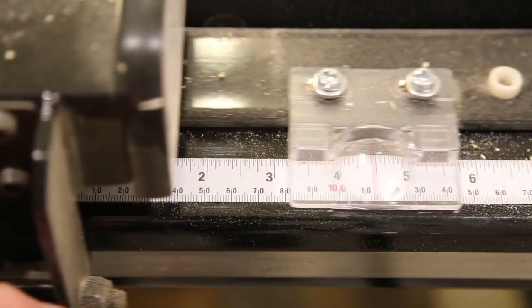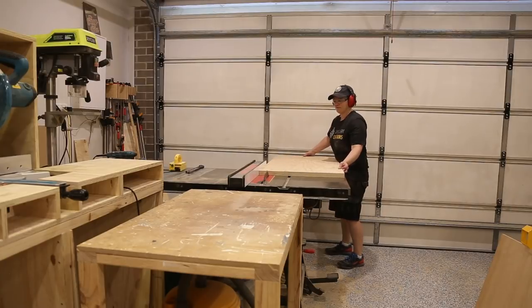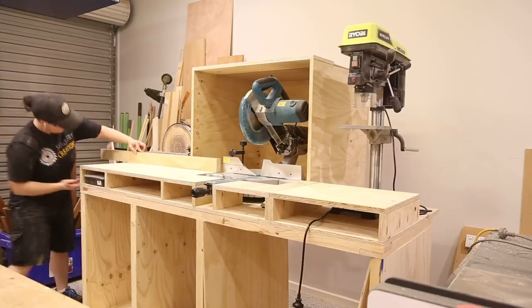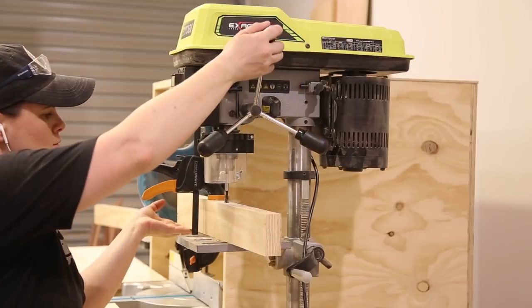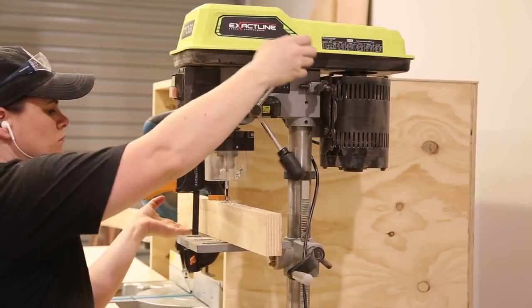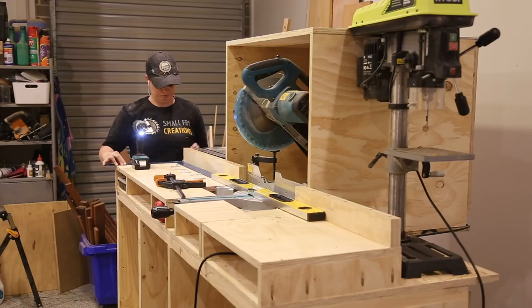The miter saw fence is made from 30mm plywood I had in the workshop — I cut 70mm wide strips. The fence sits just below the sander and will be substantial enough for the track and to support the timber. I used the drill press and a forstner bit to drill down through the fence as I didn't have long enough screws. I used a combination of framing squares and levels to align each side of the fence with each other.